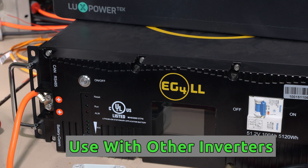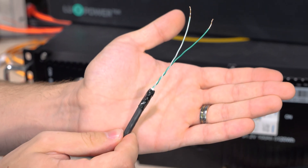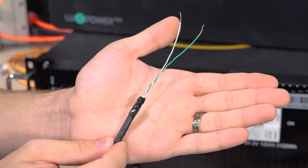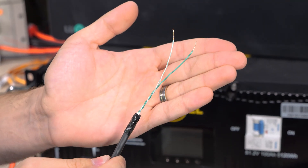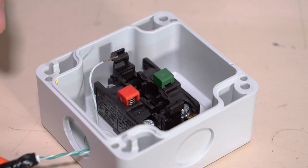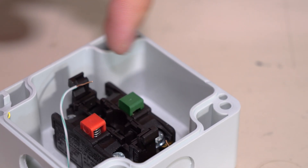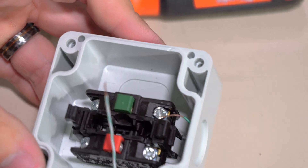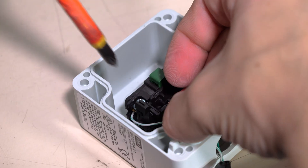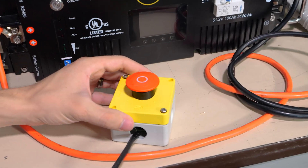This next section is for non-EG4 inverters. I've taken a piece of cat 6 cable and cut short and taped up all but the green and green-with-white-stripe conductors. I've untwisted them and stripped the ends back about half an inch. Polarity doesn't really matter here, but we want to make sure we're on the green contact — one wire on each terminal. Cat 6 cable works well here because the strands are a bit thicker, making it easier to insert into these terminals.